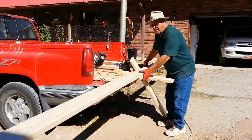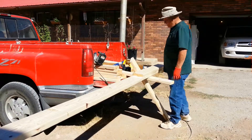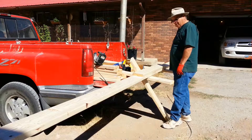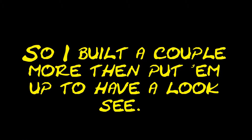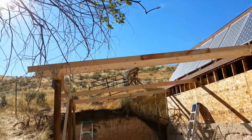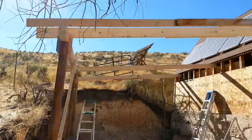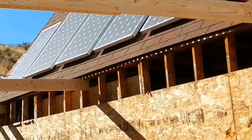Alright, there's one of the beams and that's the drill on building those. I'm going to build a bunch more of these, but for now we only need two to get both ends up, maybe three for the middle. So we'll get three of these built and we'll start assembling. There's one day's work. I left the old template rafters up there, but you can see I've got three new rafters — two on the ends and one in the middle. I pulled this wall straight when I got that, and you see they're screwed right to the top of that plate, and you can see how that cut in there makes them fit just right.